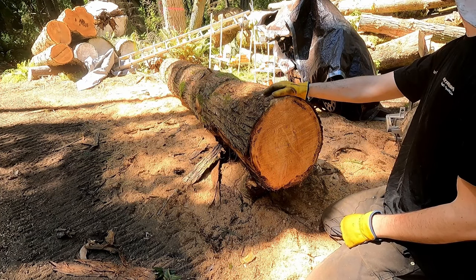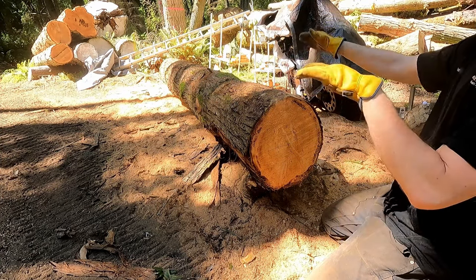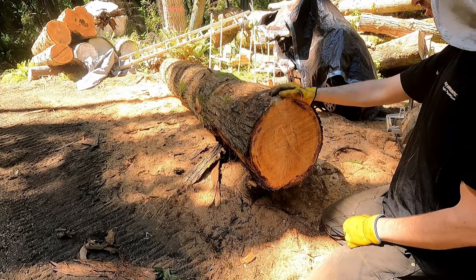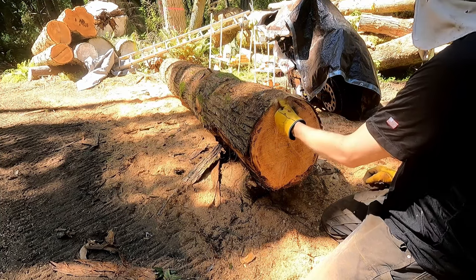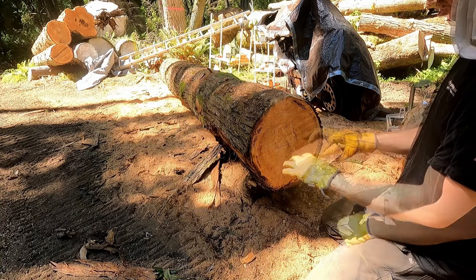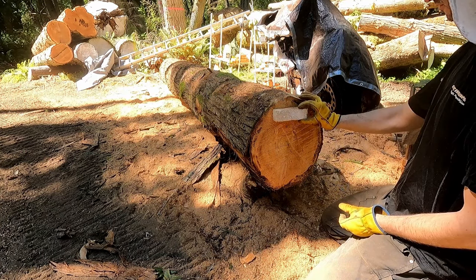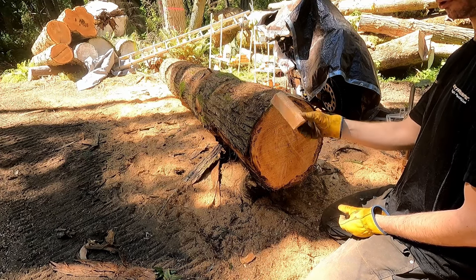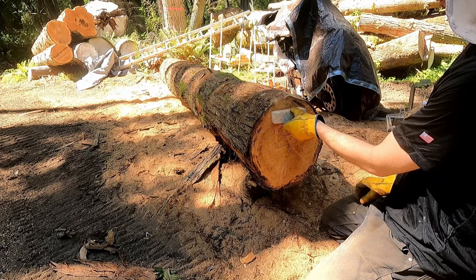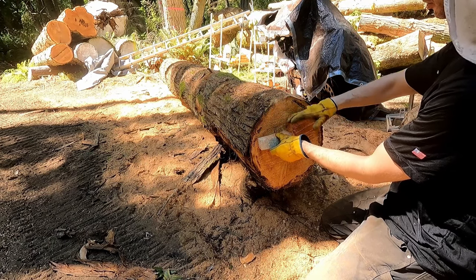Then there's a little bit of planning. The end goal is to get that ladder on top of this log straight. If you just set it on here and screw it down, it's not stiff enough — it'll follow the log, sit up high on knots, and won't give you a true cut. I start at the small end with a cut piece of 2x6 pre-planing, so it's about 1.8 inches thick. That's the thickness I'm cutting with the chainsaw mill, not the final thickness of the board. I want the first slab to yield one 2x6; waiting for a slab that gives me two would put the cut way down and create a ton of waste.